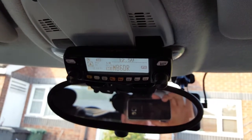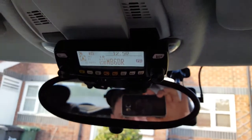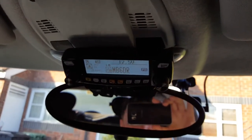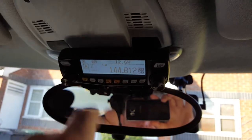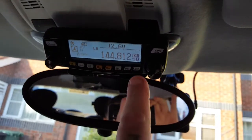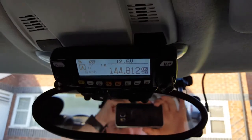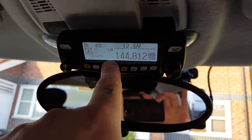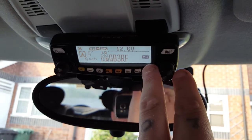This is my nearest fusion node. The downside of fusion for me is there's just not enough repeaters and nodes that are usable at my location. There's only one node connected to WiRES-X and only one repeater that's digital but not connected to WiRES-X. So if it wasn't for this guy Dave M0AUT I wouldn't be able to get on WiRES-X at all. If you hold down the button it transmits, then waits for a signal back from the node or repeater, then displays at the top what room you're in. I'm not in range now so it won't get a signal back.